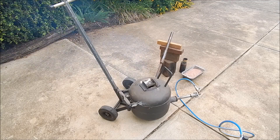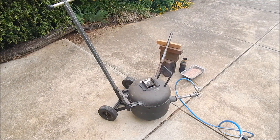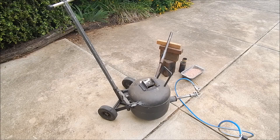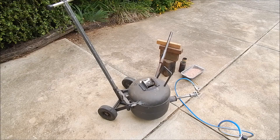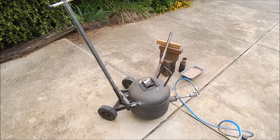When you're melting aluminium, make sure that the breeze is blowing away from you because aluminium gives off toxic fumes. You should always do it outside or have an extractor fan. Whatever it's coated with — it could be coated with some sort of plastic or polymer — that can smoke, because aluminium normally wouldn't smoke. So that smoke is obviously some sort of coating. Make sure you don't breathe any of that stuff in — it won't be any good for you.